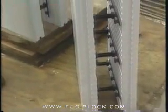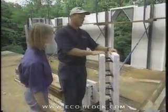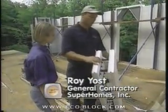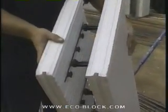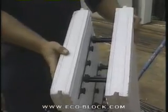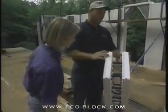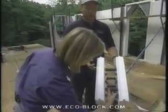Tell me about the product we're using to build this house. This is an insulated concrete form. There are many different kinds of forms out there. This particular form is a solid wall system or solid slab. It's a four-inch cavity with two pieces of EPS — expanded polystyrene — on each side. The black webs in between, these are your studs or your strapping where you can screw your studding to or your sheetrock.